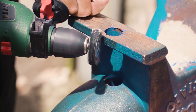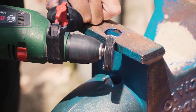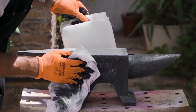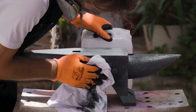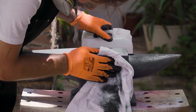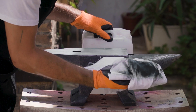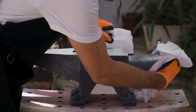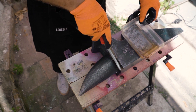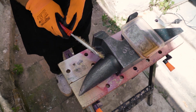All in all, the paint removal took much longer than expected, as the surface is heavily textured. I was here for roughly 90 minutes before it started to look somewhat decent. The next step is to give the anvil a solid cleaning with acetone to dissolve any residual paint. I did multiple passes with a clean rag and acetone, followed by dipping a brass wire brush in acetone and scrubbing all of those hard to reach areas, like around the base of the horn and around the lettering.